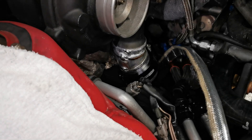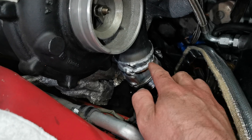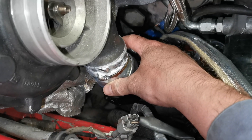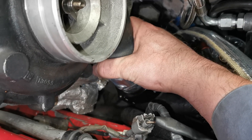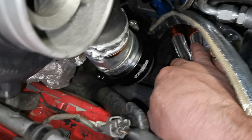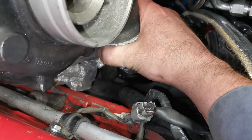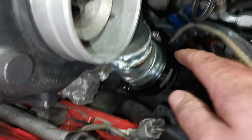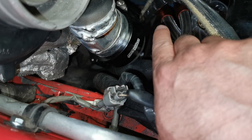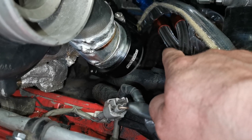After a bit of welding we have one lap completed — between the compressor cover and the cone. It's not the prettiest of welds but I think it should work. If we push the power steering line a bit, then we should have a pipe that clears. Another option would be to push the power steering line in the other direction, but then I would need to bend the power steering pipe down there.